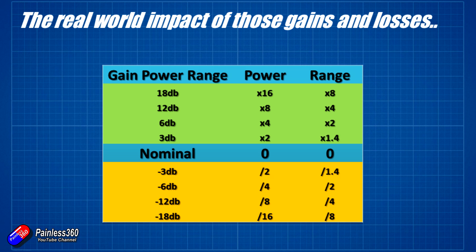However, if you had four times the power — going from 25 milliwatts up to 100 milliwatts, again if that's legal in your country — that would give you twice the range. You can also go to 12 dB and 18 dB. Similarly, if you half the power, you also decrease the range. The really cool thing is that if you want more range, you can not only change the power on your model, but also increase the sensitivity of the antennas you're using — though more sensitivity usually means they're far more directional. This graph gives you a rough idea of what the effect on range would be.